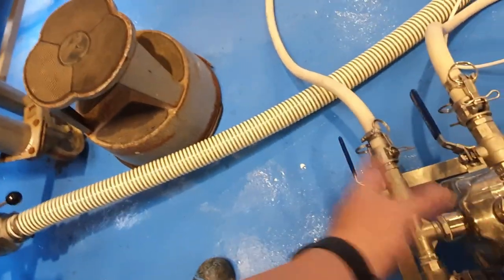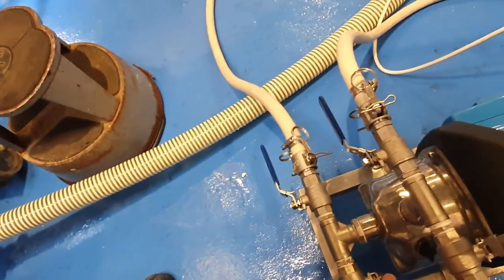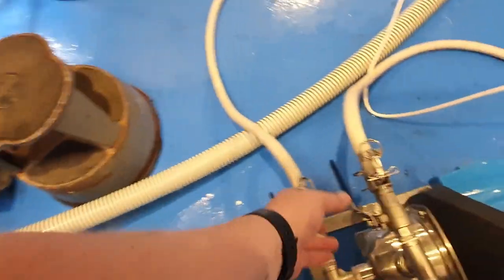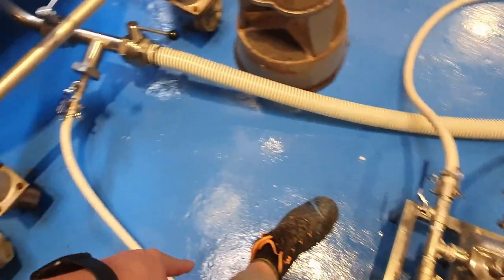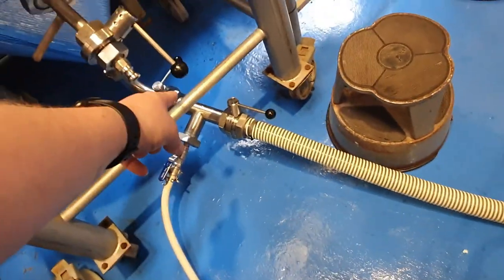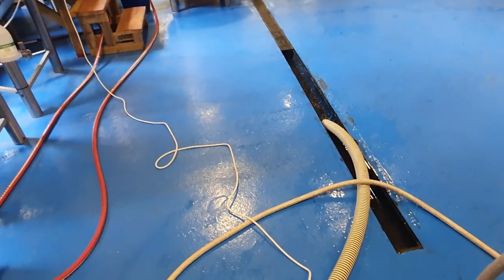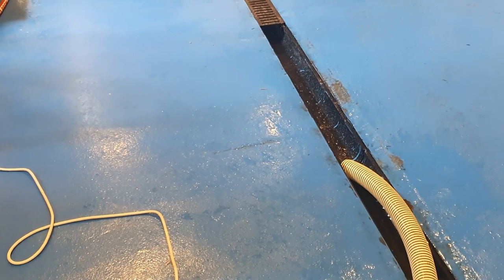I've already done it once, but I'm just doing this demonstration. So we've cleaned out all the acid out of the pump housing. Next we want to flush this pipe out as well — I open that valve, and now water can no longer make it up to this pipe, it's running around here into the little T section that we had earlier, and as you can see, away and down the drain. I'm happy now that we've rinsed out our pump.